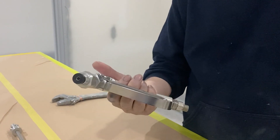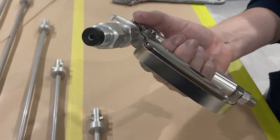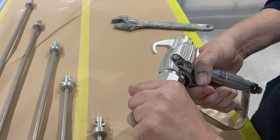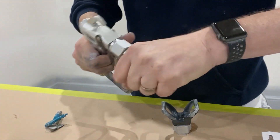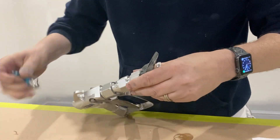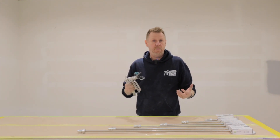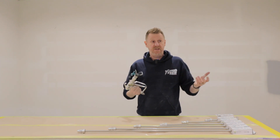So what we're going to do is set it up as you can see there. If we were working in a confined area, under a stairs, in a hallway, we want to be able to just use obviously the gun as it is. It's a small extension and then we're going to go through each of these as we go. So let's take this off first. The first thing I'm going to do is affix the adapter, add the guard, loosen the guard a little bit, add my tip. Then fire up the machine, get it all set up, put it on my gun and actually get spraying. We'll move the table out of the way and just keep coming back trying the different sizes to see how quick and easy it is to change things over.